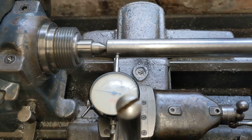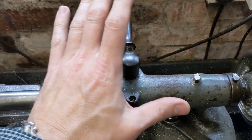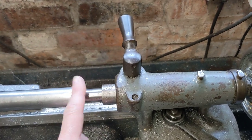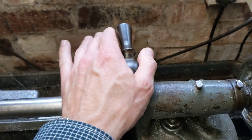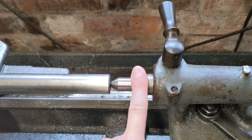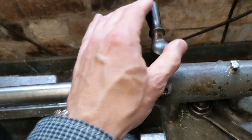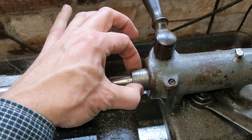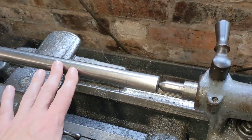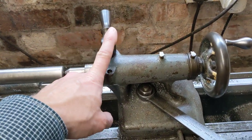One thing I'll point out that wasn't in the other video — just for the benefit of anyone doing something similar with a lathe — the tailstock: you wind this handle here and it comes out because you use it for drilling; that's where the Morse taper center is. This lock nips up the shaft, and if it's not nipped up it makes quite the difference on the reading of that gauge. So I've made sure it's nipped up tight, because when it's nipped up it just pinches that sliding bit and there's no movement at all. If you're doing this exercise on a lathe, make sure you nip this up.